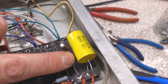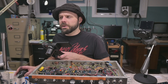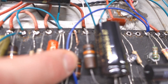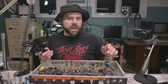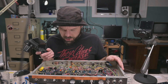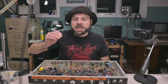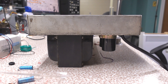Underneath this beast is a 2.2K — the schematic calls for a 2.7K but I don't have one in stock, so 2.2 will have to do. I had ample 1.5Ks, not so much 10Ks — had to get creative repurposing some old carbons; I need to order more 10Ks. But this should work — key term: should. I don't see why not. All the connections are made. We should put some tubes in this, get some power to it, and get some voltage readings.